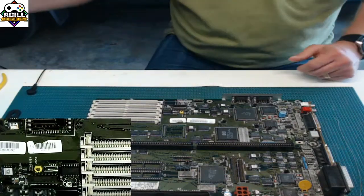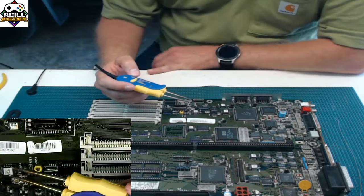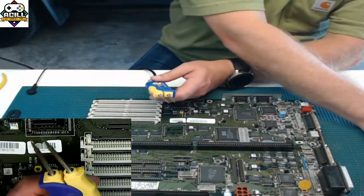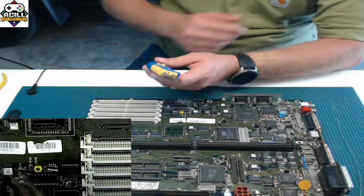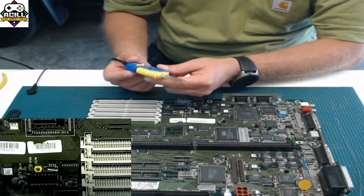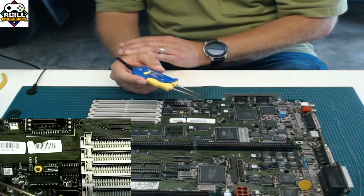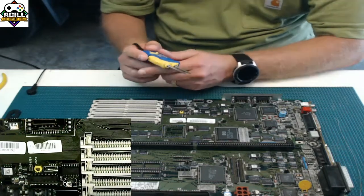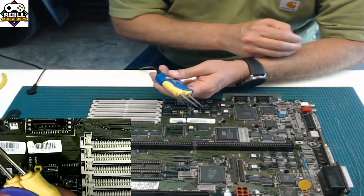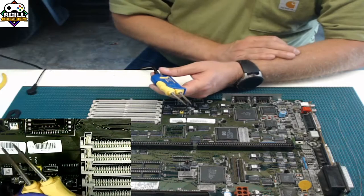is I have what's called a parallel remover. So this is the Hakko micro parallel remover, and this is an FM2023. The problem with getting this is it's not so much that they're expensive, because they are expensive, and it's not so much that they're hard to obtain. It's that the base station you need with this particular one, the minimum base station that you can use is a FM202, which is very old, and you really do not want to use it with this because there's no sleep function in it. These tips are hot. These tips are about $45 to $50 a piece, depending upon where you go.